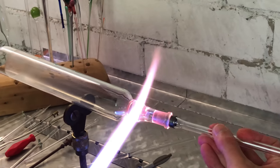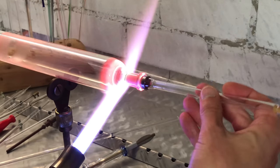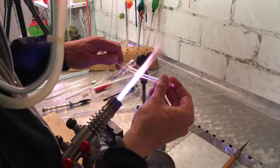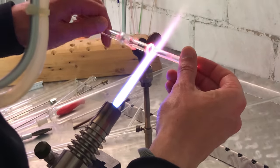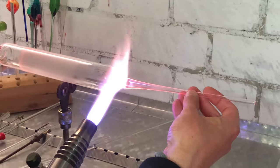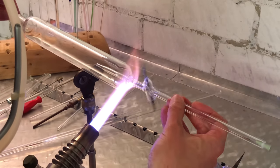The NS14 glass ground joint is then attached to this hole - this joint is where the metal will at some point be added. In the next step, the nozzle of the fountain was attached to the pump. The pump only consists of the two electrodes in the T-piece. At this point, a thickening is also created on the glass, which is of crucial importance in the following step. Johann opens a hole in the other end, which will later be the bottom of the fountain, to be able to melt the nozzle into the main tube. The thickening serves as a shoulder that rests on the edge of the hole, and enables Johann to fuse both pieces together.